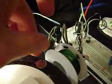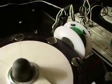The reed relay here — this little thing is a post that has a diametric magnet on it, and when you turn it you can polarize the reed switch to only activate on the north or the south magnet. So it only activates four times per revolution, but I get more speed out of it. So I guess it's a plus to have alternating poles coming out of the rotor.